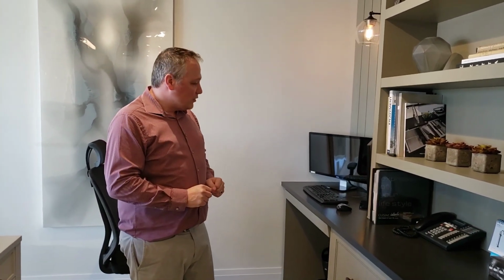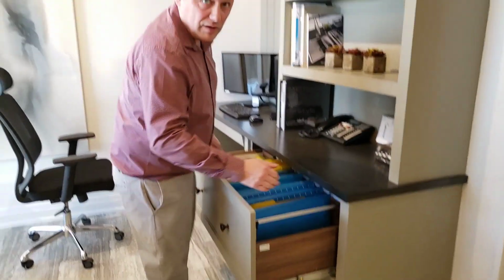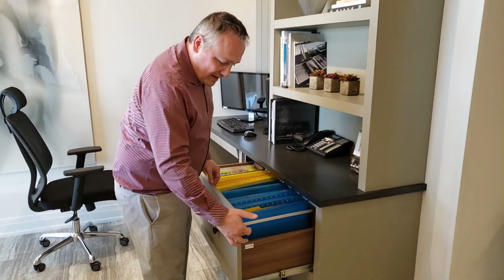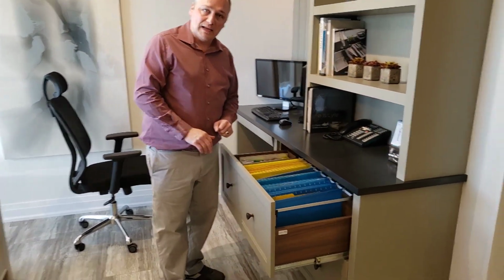Now, another useful drawer that people like to use a lot, even in your kitchen, is for when you want a little workstation or something like that. So you see we have one of our little stations that we use to do our pricing and our kitchen work here. This is a file drawer. It's basically the same construction, whether you're using melamine or a dovetail drawer. And then what they do is they add this extension on the top here for your front, and they put a pin of metal here, and on the side there's a little rack that they add in.